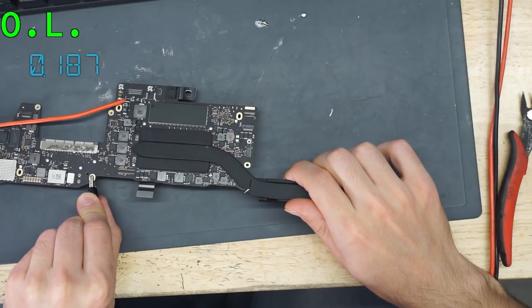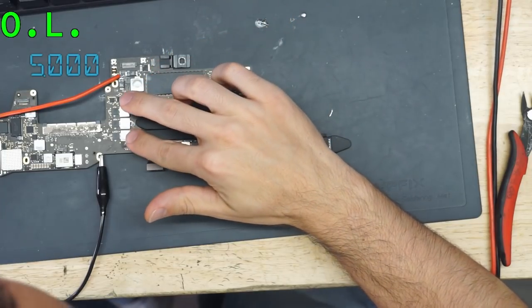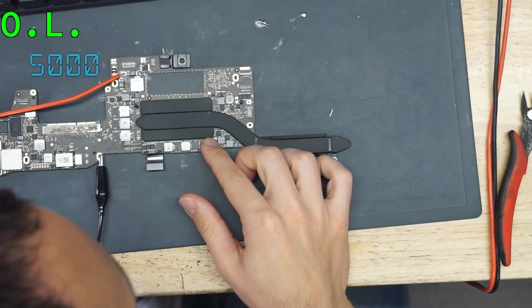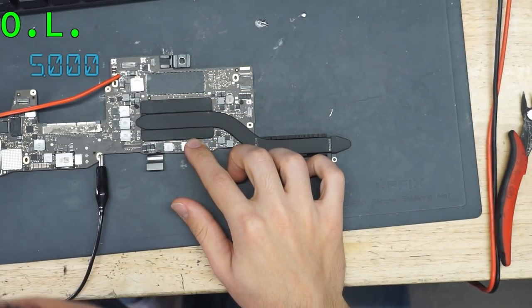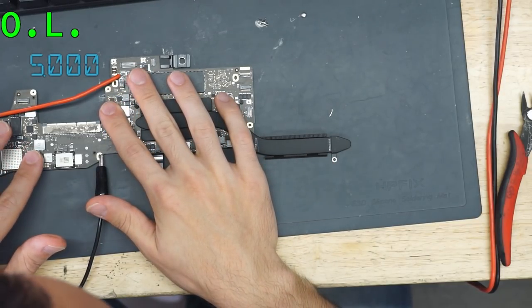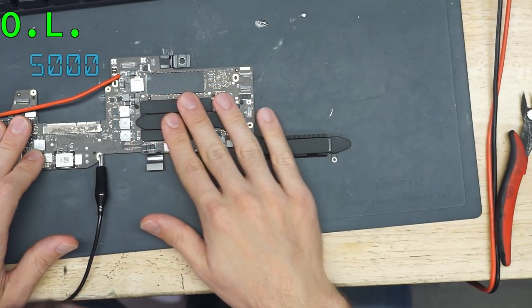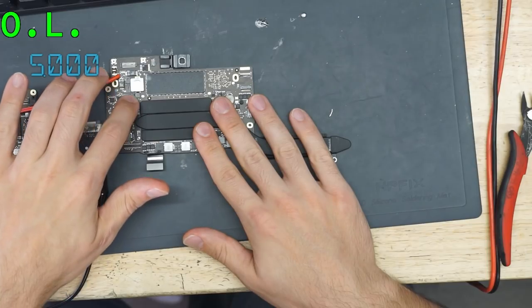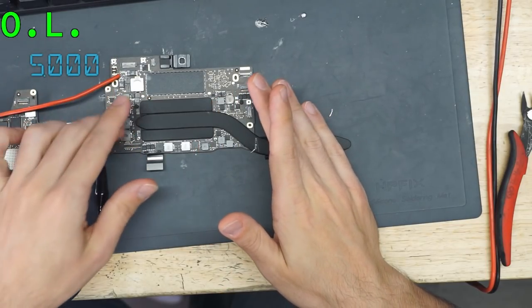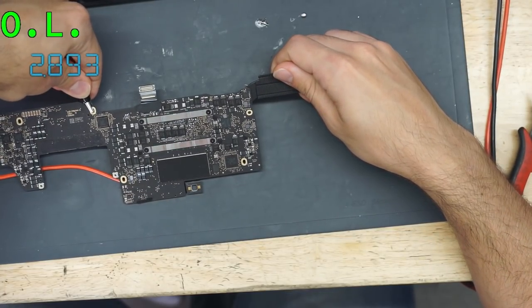Okay, so first off, let's make the ground get a better connection over there. Is it you? I'm going over common areas for PP bus shorts. We're going to hope and pray it's not the CPU. Actually, it can't be the CPU because it has to be on the PP bus G3 hot creation side. Okay, this actually makes it a lot easier.